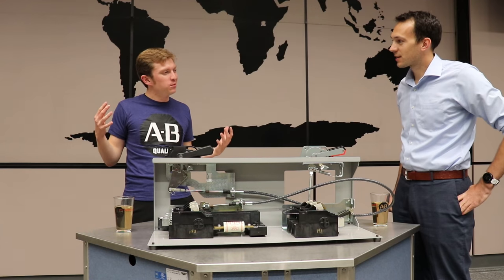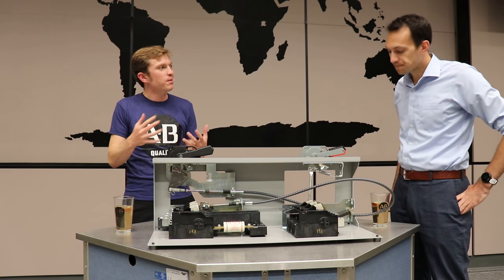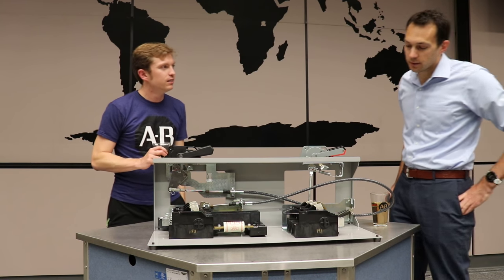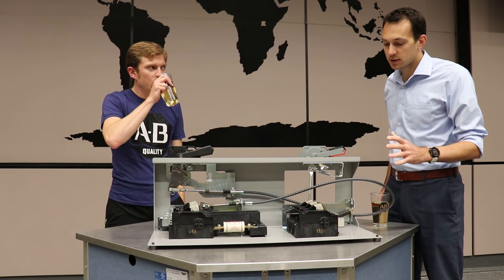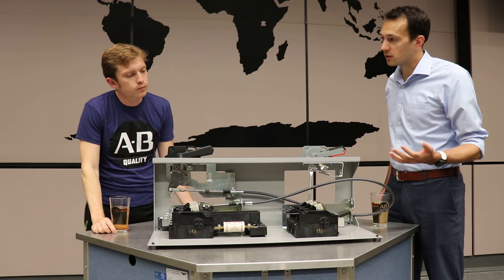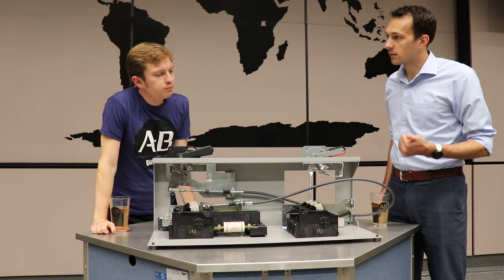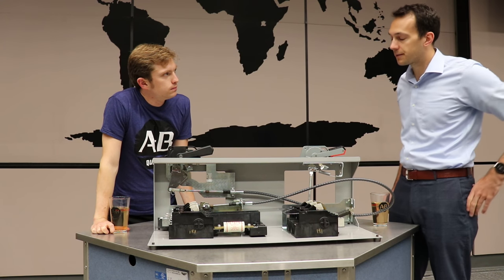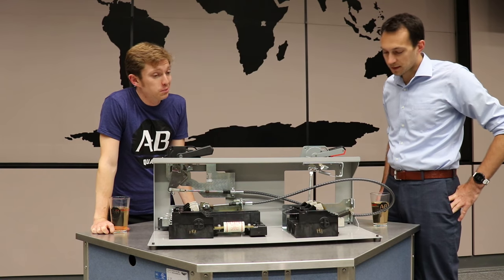As far as space savings — we were talking about that too. How does this offer space savings based on the components that are inside of it? Yeah, so one of our great new accessories that we offer on all of our switches is a multi-port lug. And what that does is it allows you to get rid of your distribution block. And if you can do that, you can get rid of your wiring, you can get rid of cost, and you can save a lot more space and put your switch where you want it. A lot of savings across the board.